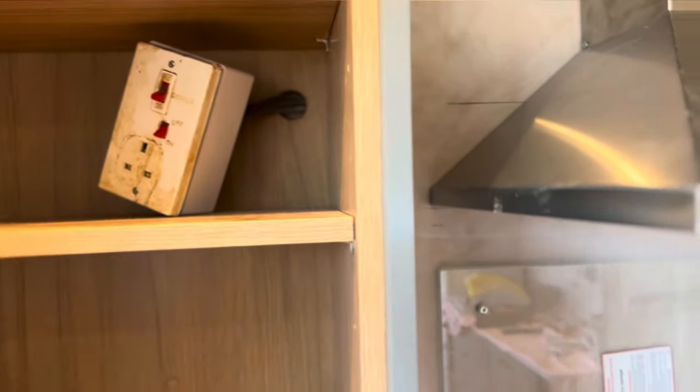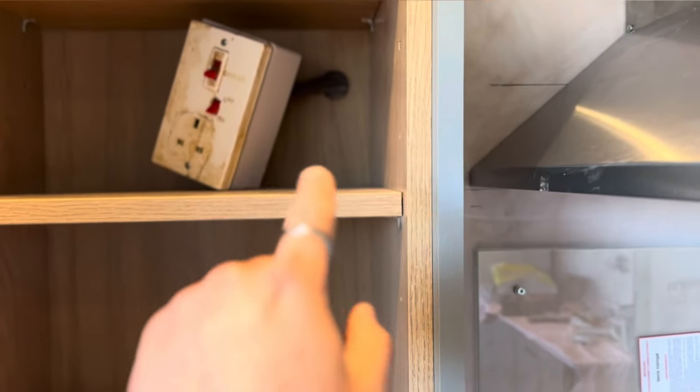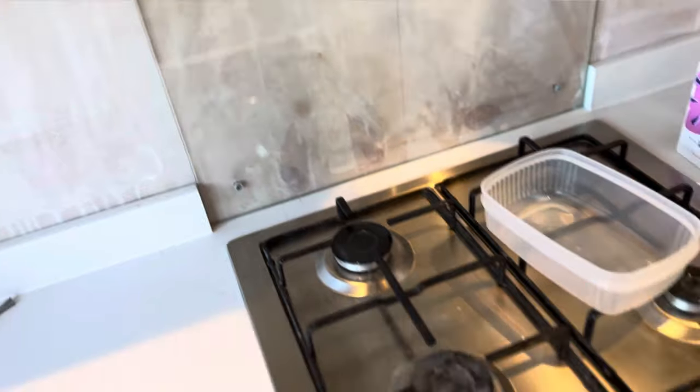We had to rewire part of the cooker circuit because it was weird to move it all. And the leg that came down and out for the actual outlets was actually above the work surface. So it was here, there was a box, and then the flex just dove down beyond the worktop. It looked terrible. So I hadn't quoted to move that, but we've done it.